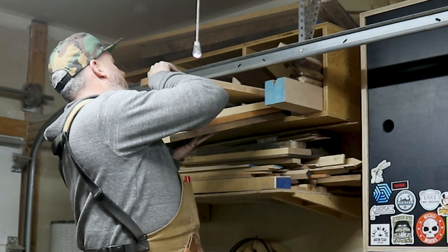After I got everything down to the same thickness, I went over to the jointer and made sure I had one good edge. A lot of the stuff was cutoffs, so some of the edges were a little wild. About two years ago I changed out to a helical head on my jointer, and it makes a huge difference — not only in the finish, but also in the amount of noise it no longer makes.